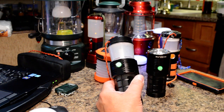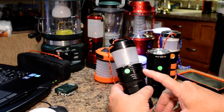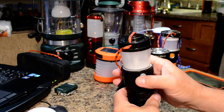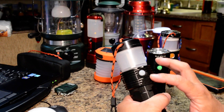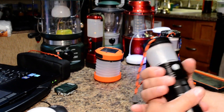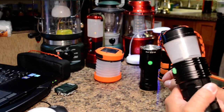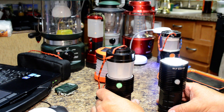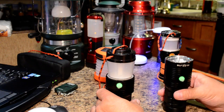For the body section, we mentioned in the last video removing the lower fins and creating knurling so you can still physically lock out the lantern by a small turn — preventing accidental activation. This will be easier to grip, and the fins are no longer needed since they were supporting the LED board for heat dissipation, which is now up top. The lantern won't be driven as hard as the Q8 since it's designed to run continuously for long hours — running on maximum mode for more than 10 minutes gets really hot.